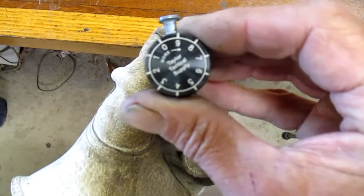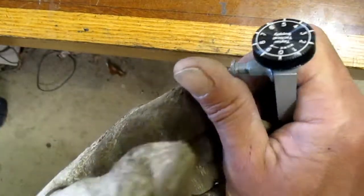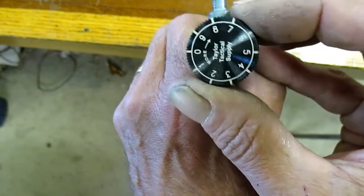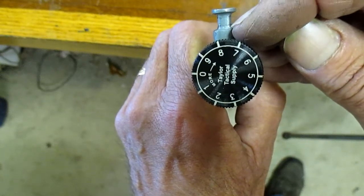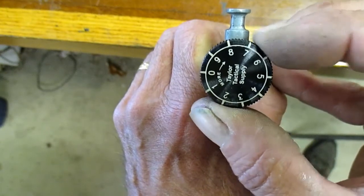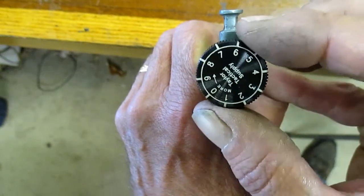Now I have adjustments on there — you can see the graduations, and that'll be a nice thing. When this is on the press, you're still kind of guessing where it's all going to be. So I think the next thing I'm going to do — you can see how this shoulder sits up higher and there's enough room — is drill a hole here and put a piece of musical wire that comes out as a pointer. I'll put a little white paint on it and it'll be a lot more accurate as far as actually seeing the numbers.